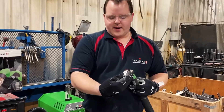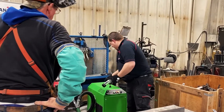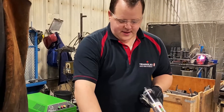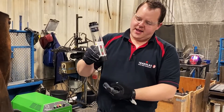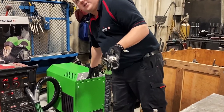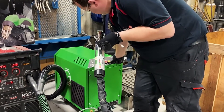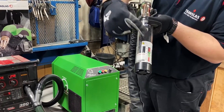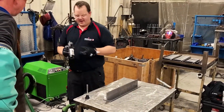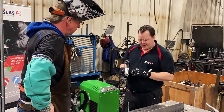The only way we know that is because we created some parameters and a set of tools. We have three parameters that we need to follow to get the best possible outcome. The first one is the air flow meter — you'll see here, this is like a ring. I'm going to slide the gun into here with the suction turned on. We need to be somewhere between 34 and 36 CFM. That's in the green. If I'm down in the red, lower down, I won't be pulling enough fume away. If I'm higher than the green, I'll be pulling too much and will have a porosity issue.